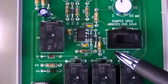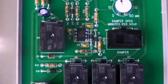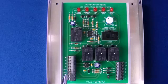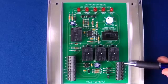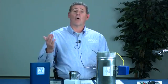The panel waits until there's a call from the system. We also have an override switch that keeps the panel in either automatic mode or closed, so you can shut the system down completely. On the left side of the panel is where you wire in from the air handler, wire your damper in, and your 24-volt connections. On the right side, our panel gets a little unique — we have a couple of terminals for an exhaust fan. If you're installing an exhaust fan or there's already one in the home, you can wire the system into that. When the VCS opens and begins to bring fresh air in, it'll also kick open the exhaust fan, allowing the home to have more air turns and more fresh air coming through.